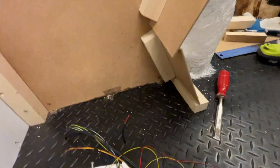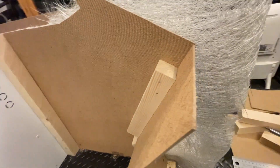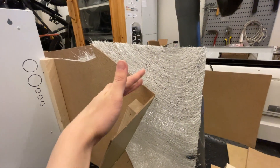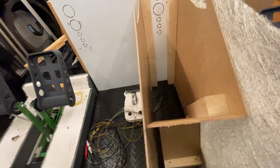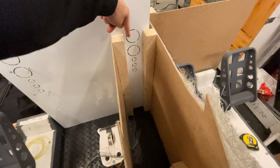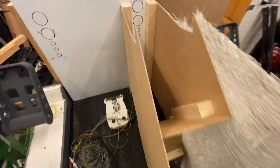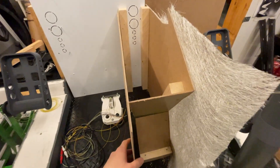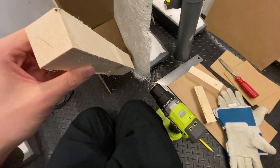You can see it's pretty nice. These 40mm pieces back here — it doesn't really matter what length they are, but just make sure that we have enough clearance here for all the electronics and screens and everything. I cut that hole, and I also cut the hole on the other side at the same time. I already fastened it with one screw from the electrical box side, so it's in the correct position. This measurement is 75mm here, and then this is the same as at the front — so 153mm. With the back fastened, we're going to go ahead and fasten these on.